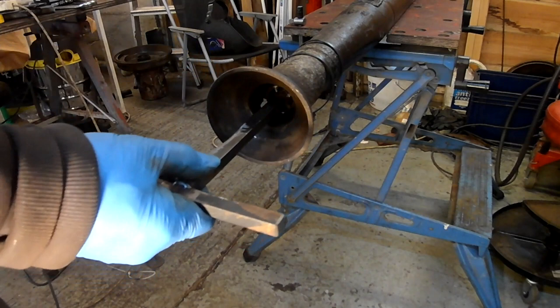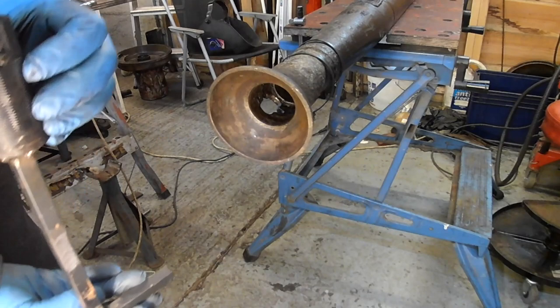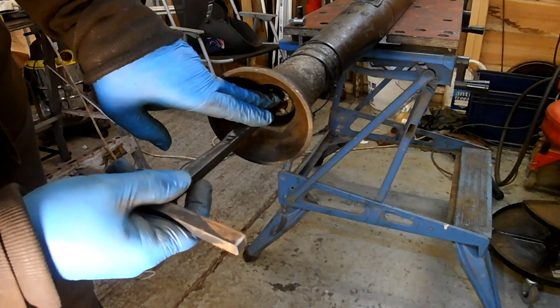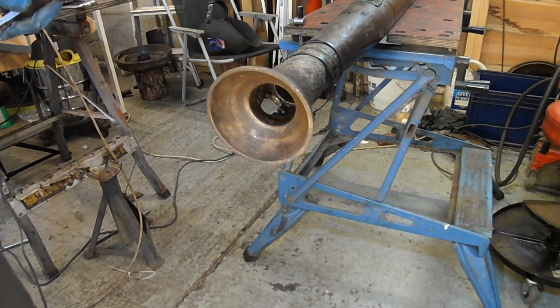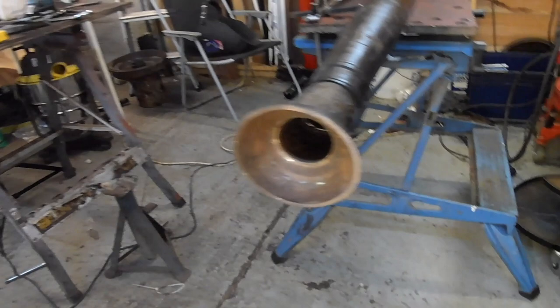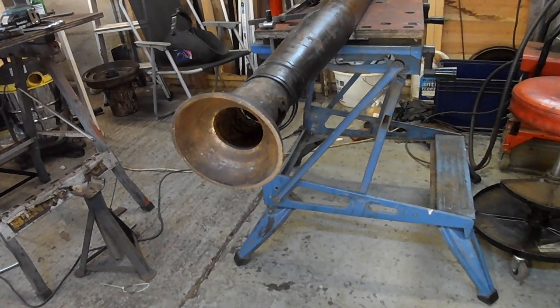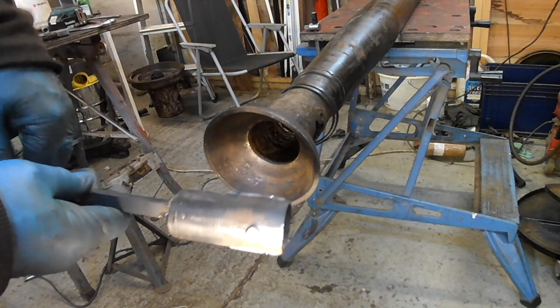That's in the slot. I think it's coming out because of the radius I've got in there — I might have shaped this a bit wrong. That's in the slot but it's coming out as I turn it, so I think the diameter might be too small. There's a video on YouTube I'll go and have a look to see what I'm doing wrong. I've made the peg a bit bigger — put some weld there to kind of up the diameter a bit.